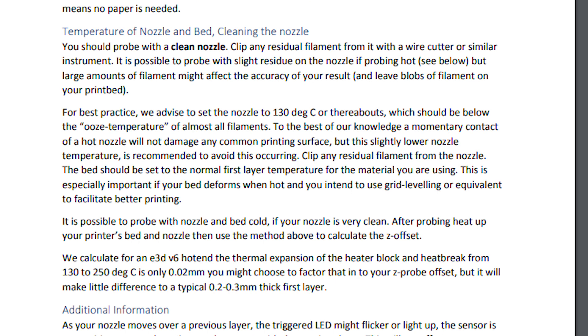Don't forget to set this in your start G-code in your slicer. If you don't set it up properly, most slicers will default to probing at printing temperature, which as explained won't work. So you need to make sure the bed is heated, then heat the nozzle to 130 degrees Celsius, then probe, and then heat to the printing temperature. It's also a good idea to probe with the bed at operational temperature since 3D printer beds tend to bend slightly when heated.